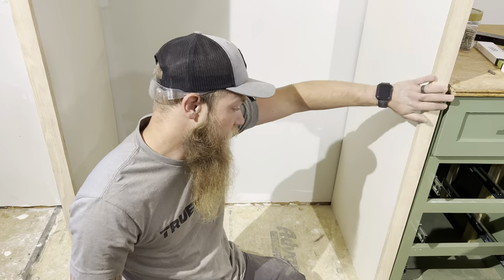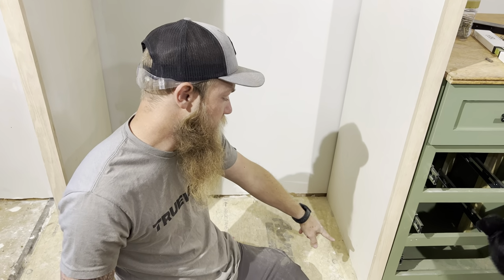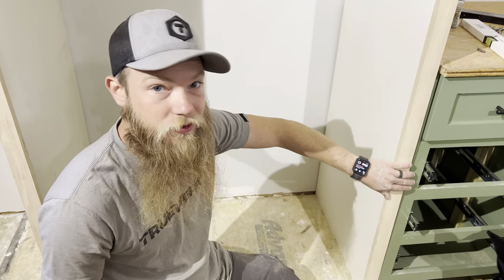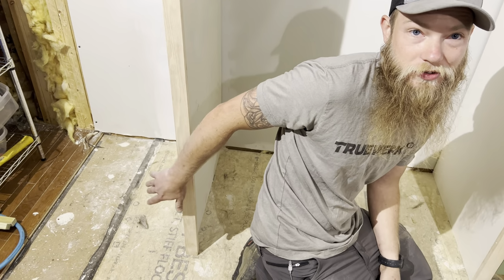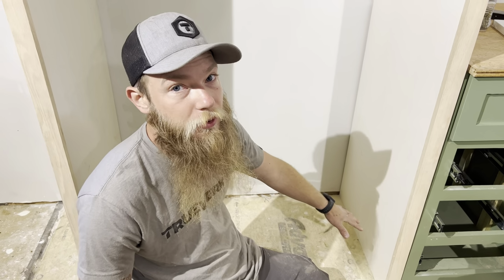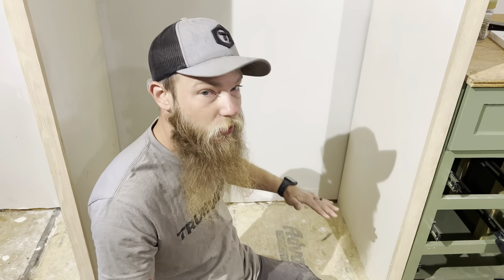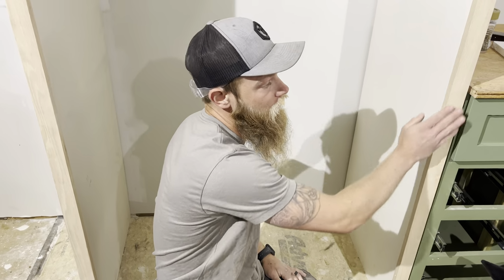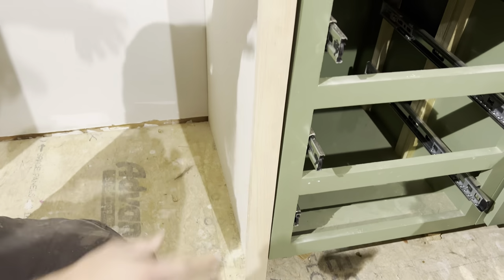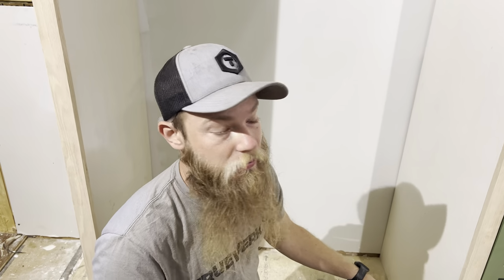All right, a couple things whenever we are installing this. One, we're going to put some pocket hole screws in the bottom, that way we can secure it down to the floor so these things aren't flapping, which this one will be fine. It's this one that we're worried about because there's nothing that this one's going to connect to. So we're going to put some holes in there first, but we're not going to put the screws in because the floor is not level. But we want this level, and this needs to be pushed back here in order to match this frame, which is level. We've already checked that. So we're going to hold off on the screws, but we're going to go ahead and put the holes in because once we screw this into the face frame, there's no getting underneath it after that. So that's the first step. Yeah, good catch on that one.